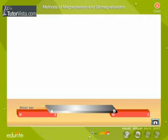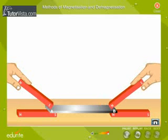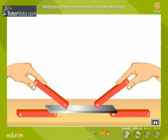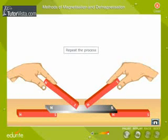Double-touch method. Place a steel bar to be magnetized on two bar magnets as shown. Now place opposite poles of two strong magnets at the middle of the steel bar. Move the magnets towards the opposite ends of the specimen, keeping the magnets inclined. On reaching the opposite ends, lift the magnets and place them back to their respective original positions. Repeat the process. The polarities developed at the ends are opposite to the polarity of the pole used for magnetization.